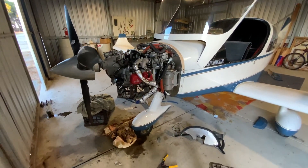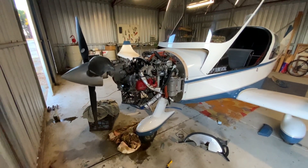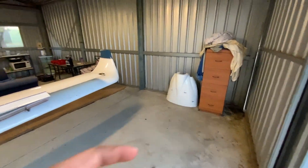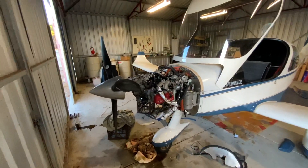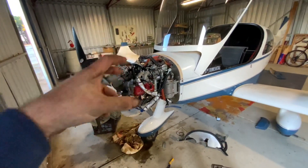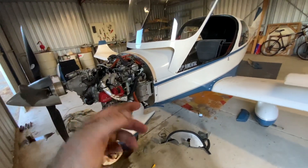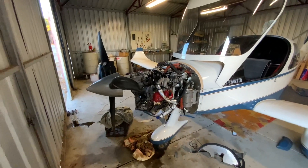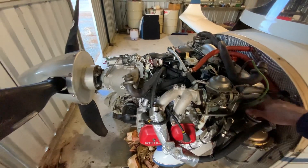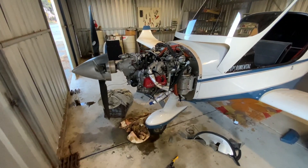So my instinct that the baffling really isn't usable is backed up by other installations — there was just too much stuff and it's literally not needed. But it does mean when we get this thing ready to go, we will need to do some testing with this cowling to make sure we have adequate airflow and cooling. There's nothing that pops up weird with hot air on the inside, the intake holes, the exhaust exit hole — this thing has cowl flaps and all of that, so there'll be some interesting work when this aircraft finally gets flying again, probably in five to seven weeks.